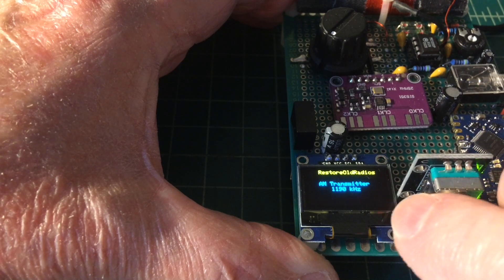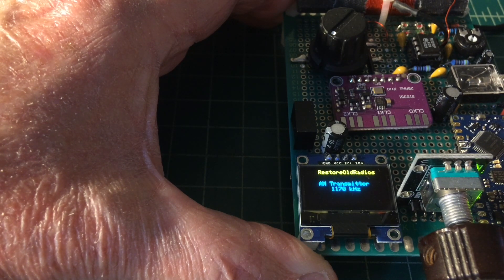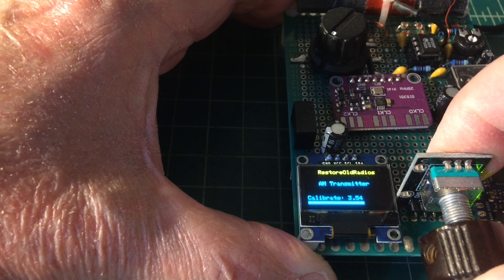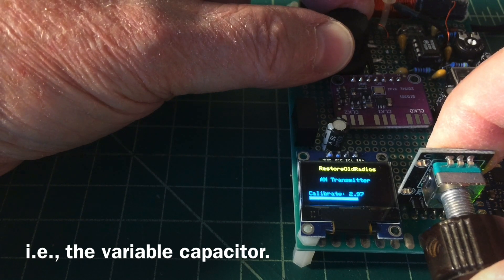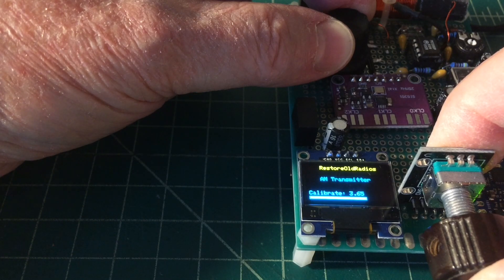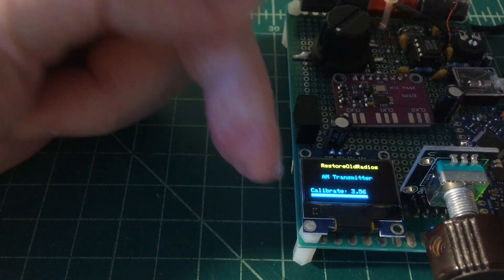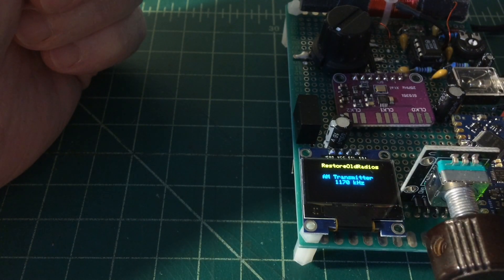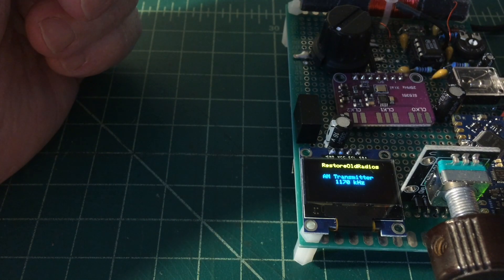To tune the unit, we can just rotate the rotary encoder. I've got things set for 10 kHz steps in the sketch, and you can adjust that. If you hit the switch on the rotary encoder, a calibrate mode comes up. You can take the tuning condenser and adjust for the maximum signal using the readout value or the bar graph. When you let go, it holds that position until you rotate the encoder, which creates the purest sine wave and brings the LC circuit into resonance.